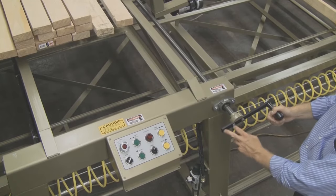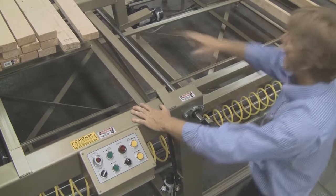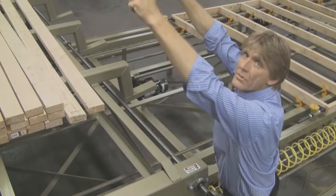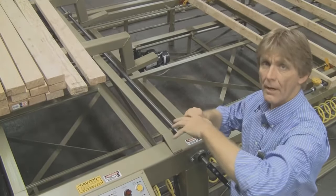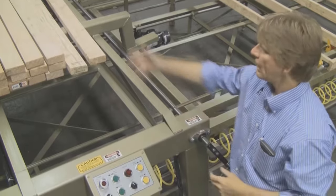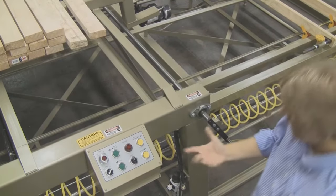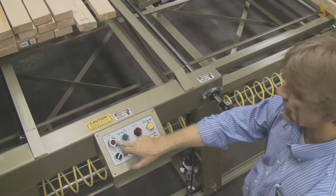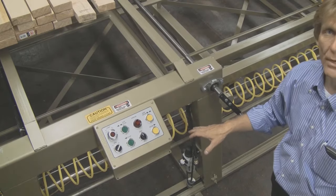There's an adjustable feature here with several holes — you can move it clear out to the edge. Generally, about 2,000 pounds is on here — about half a bunk of OSB or plywood — because the higher you get on this thing, you're out of the guys' reach. You want the bunk about halfway down. They unload, send the bridge back, somebody puts another half bunk on, and away you go. For 2x10s and 2x12s, load the thing — put a full bunk on and get going. We've also got power into the bridge itself, and every time we disengage it, we shut the power off. There's an SMC dump valve that dissipates and dumps all the air so the bridge isn't going to want to drive or stub somebody's toe.